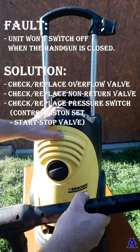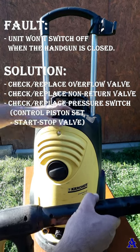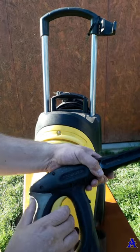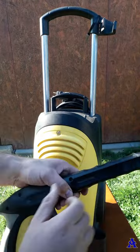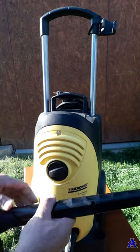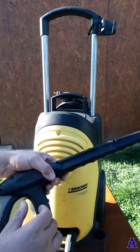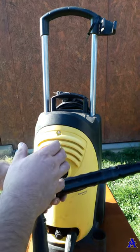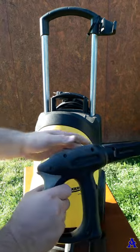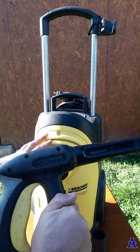The older power washers 20-25 years ago, that was a normal thing because they were running kind of a bypass system. Bypass system, it means that you were pressing the trigger and the machine started to create the pressure, but the machine worked all the time. But with the newer models of the pressure washers and especially with the professional class, they've got built in the start stop system. It means whenever you press the trigger, machine starts the engine and is creating the pressure. Whenever you release the trigger, the axial engine stops.